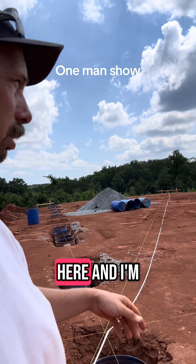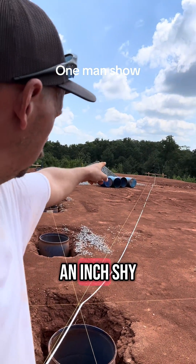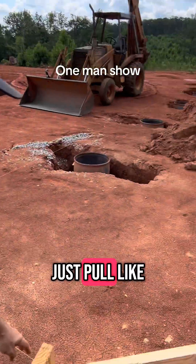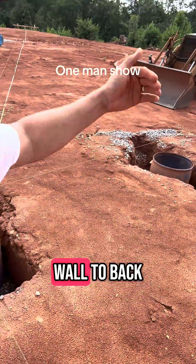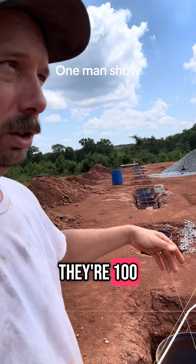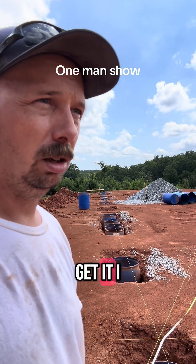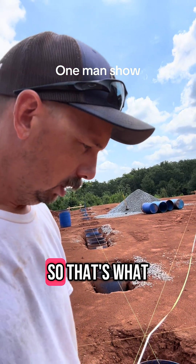I did three and a half plus 111 foot 9.6 and checked my stuff. I'm within an inch on both — dead nuts going that corner to that corner — and about an inch shy on that side, so I have some adjusting to do. What I can do is pull from front wall to back wall and check if they're 50, then side to side and check if they're 100, make adjustments, re-measure, and get it within about a half inch if I can.